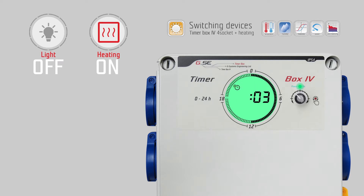Turn right to go to the current time setting and push the encoder to set. The hours of the watch start flashing — turn right to increase or turn left to decrease the hours from 0 to 23. Push the encoder to save the hours; the minutes start flashing. Set the minutes the same way, from 0 to 59, and push the encoder to save. For example, we set the clock to 22:30.